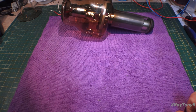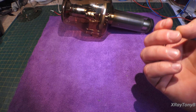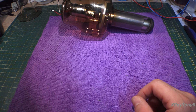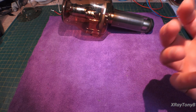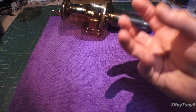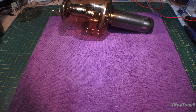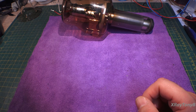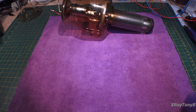One of the byproducts is whenever an electron is accelerated from the cathode to the anode and actually strikes the anode, a reaction takes place between that electron and the metal anode. In most instances, the reaction is a conversion of some of the energy from electrical energy into heat energy — about 99 percent of that conversion is heat energy. One percent, though, is something different. And that something different is x-ray.